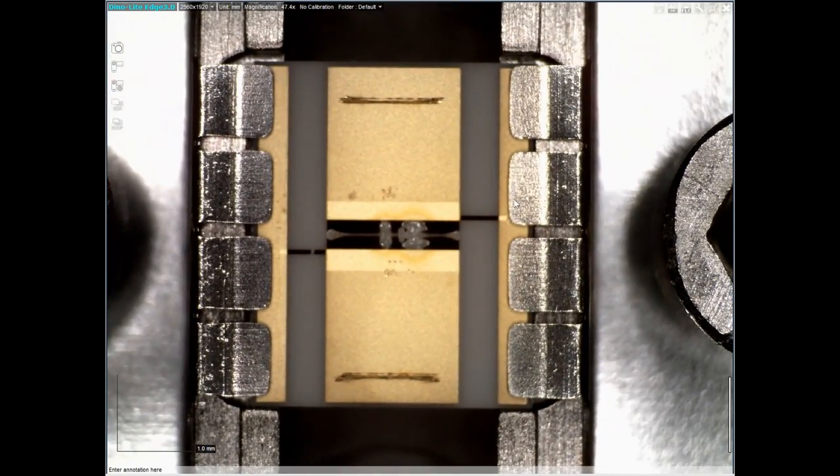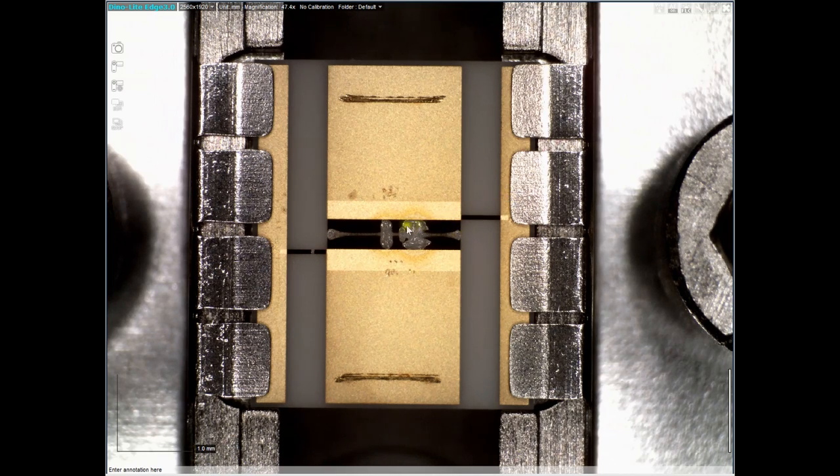There's a resistor here, and this resistor in combination with another accomplishes two tasks: it does resistive division to give you the 2 dB attenuation, and at the same time you maintain 50 ohm characteristic impedance through the 2 dB attenuation — because this has to be a 50 ohm in, 50 ohm out, coplanar structure. You can see the impact marks of the blades on both sides. So this one is not working. No matter what I selected — 2 dB or 4 dB — we had a lot of loss, and we weren't getting the proper 2 dB difference between them, so it looks like both 2 dB attenuators are bad.